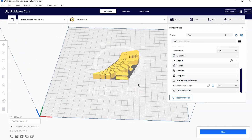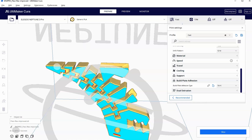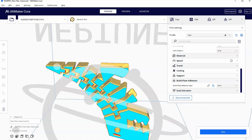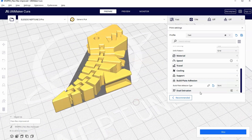If I put 10 on a bed, maybe two of them will fail. Where it will fail is actually at the last few tail pieces — not the end, but on maybe one of these three where there's not a lot of surface area touching the plate. It doesn't always happen and it doesn't usually happen, but it does happen sometimes. For that reason, I might not use a skirt to slice this.